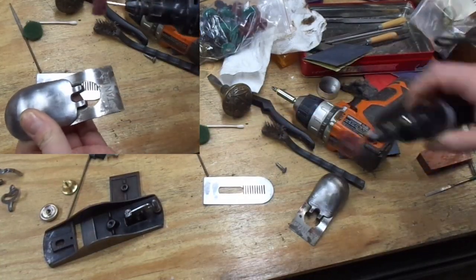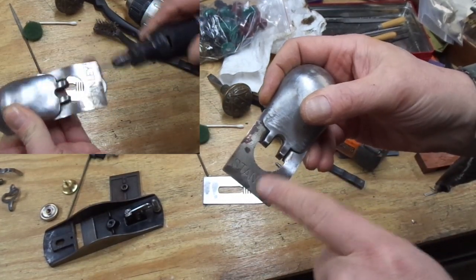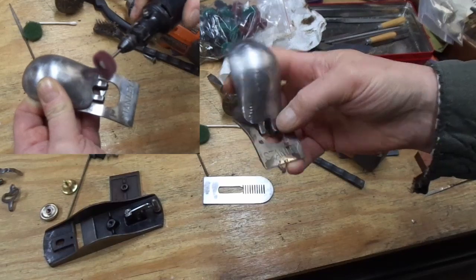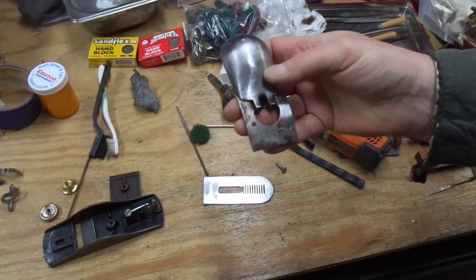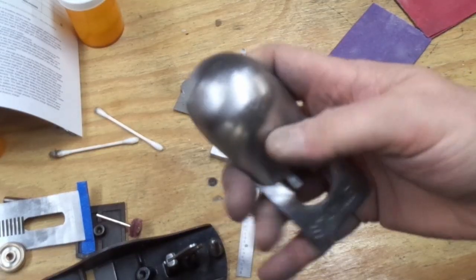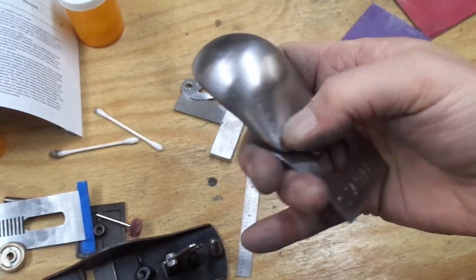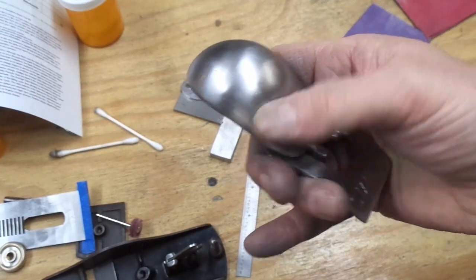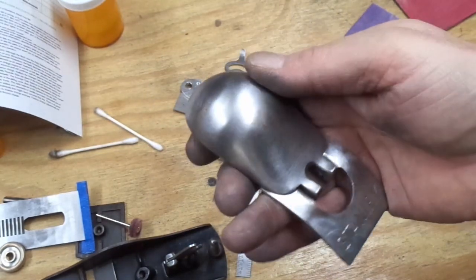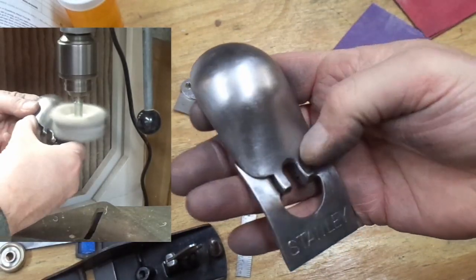I've been using this abrasive disc on my Dremel tool on the lever cap here. When I started to hit the copper plating that was exposed, it was peeling off the nickel to show copper underneath — it looks like there's copper over the steel and then nickel on top of that. I hit it with a wire brush, which did a lot to remove the rust. Then I hit it with a worn narrow belt sander, and unfortunately the edge of the belt dug in and put some grooves in the edge that I had to sand out — a little bit of a drum sander and 100, 150, 320, then 600 grit, and then I polished it.